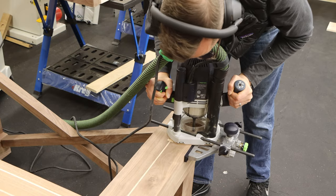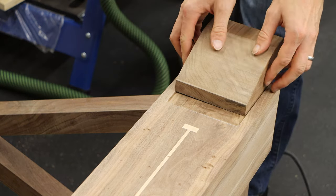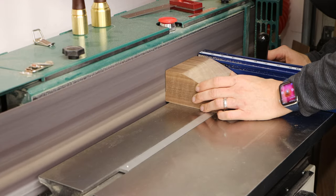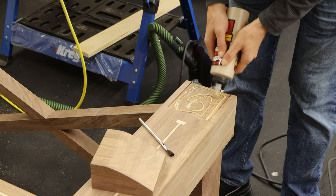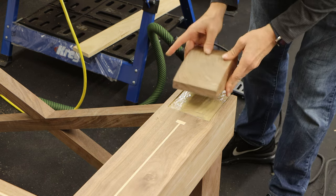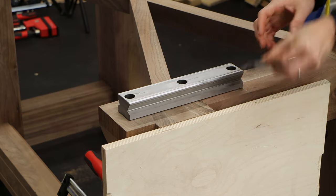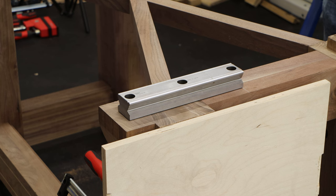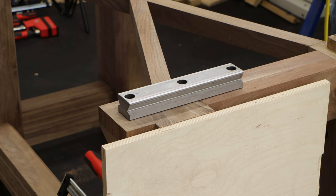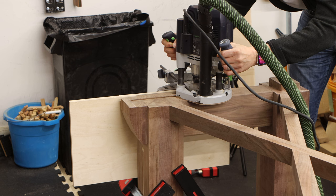The insets are cut using a router with an edge guide to define each of the sides and then the bottom, then carefully clearing out the remaining waste. Once I verify the extension fits smoothly, I can square off the corners, then rinse and repeat on the other leg. Because it's end grain, I want to avoid edge sanding once it's installed, so I clean up the top and bottom edges now. Both extensions need to be perfectly level with the already leveled base and fully fill the inset, so when I'm sure I've got it perfect, I glue them in using Titebond Dark.